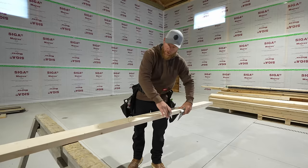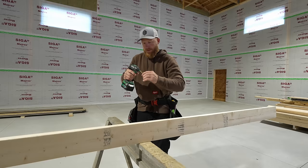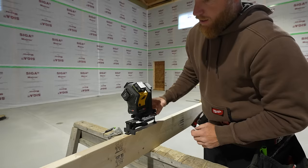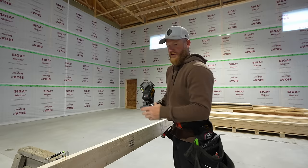I'm going to square these marks around and put a screw on each one of my marks. Then my Stabila laser — I'll be able to set it right on that mark, and when I turn the laser on I can set it so it's always hitting the two-foot on-center mark. That's going to give me a perfect line all the way around the building where I need to put my girt. Let me get this done, we'll set it up and see how it does.